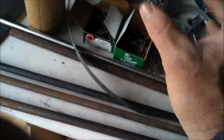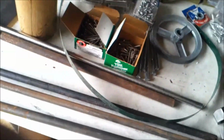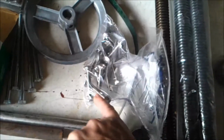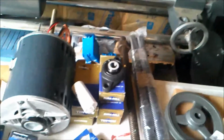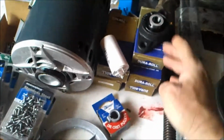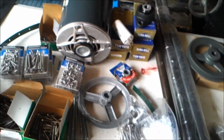So these stainless steel screws will be used to hold the slats in the press barrel, and I've got a bunch of those available. So there's our screws for the wood screws, and the last thing we need here is some stainless steel 5/16 that are 2-inch. These are going to be used to bolt our flange bearings to the side of the scratter box. So we got two bearings per each scratter box. Like I said, we're doing 3 of them here.